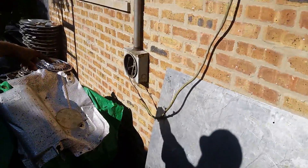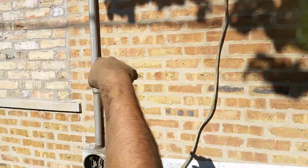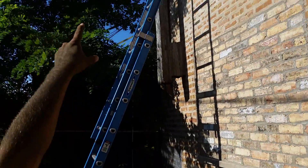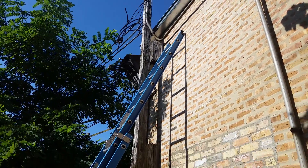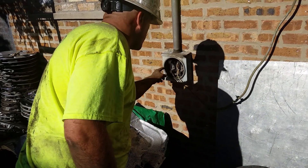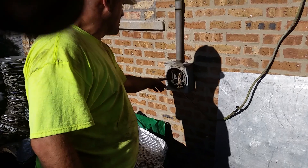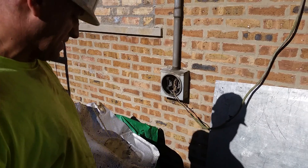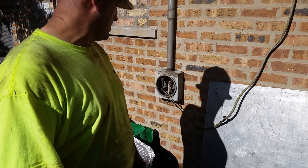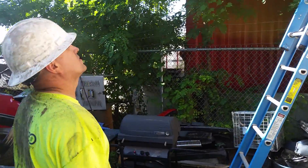There's the 100 amps - I just temp'd this in. On the other side I have receptacles on the other side of that cord I made up. If you look up top, that's tied into the 120/240, so I'm just getting 120 off of it - one leg and the neutral. Both legs would be 240. Everything inside the building is off because they've got a steam-powered pressure washer going.